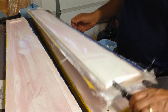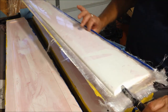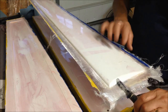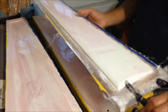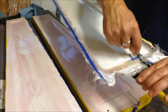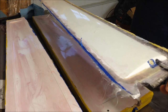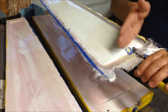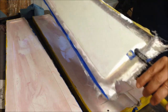Now all I need to do is clean up the edges. There's flashing around the edge — this time I'm going to be careful not to go right into the edge of the part, because I want to keep a little bit there since that's what's holding the two skins, the top and bottom, together. Although this is filled with polyurethane foam now — I drilled a hole in my mold and when they were clamped together I filled it with polyurethane foam, all the way from tip to root. It gives it tremendous stability and rigidity.